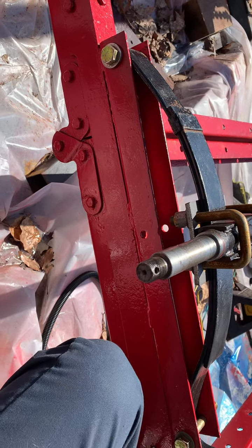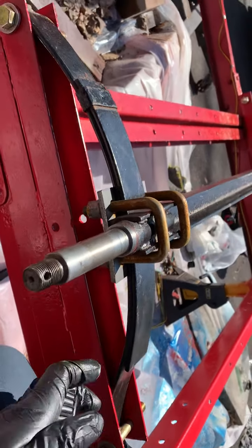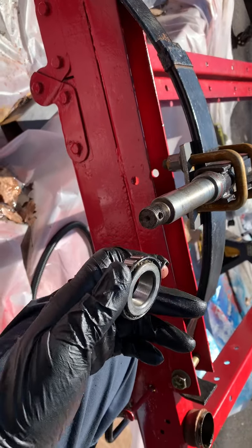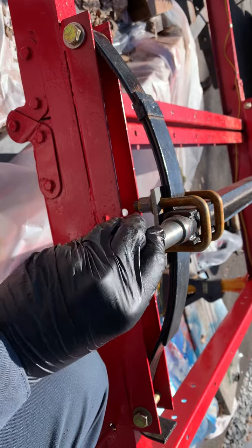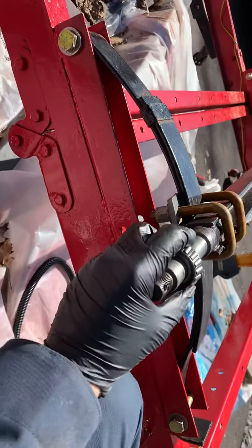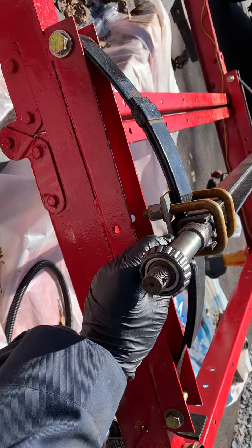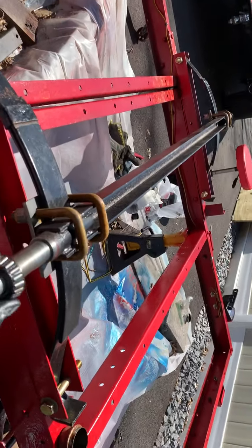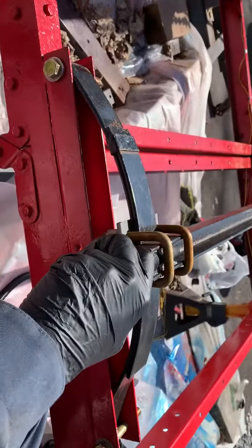Because of the gouging and these striations — see here — this one came from the right side. When I go to put this bearing on here, it won't go. I think that's the right size bearing — Evan agrees. I think because of these markings they put a larger bearing on there to slide over. So that's my problem.